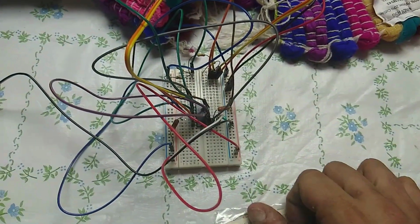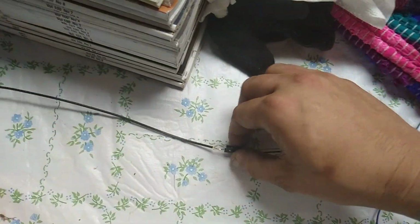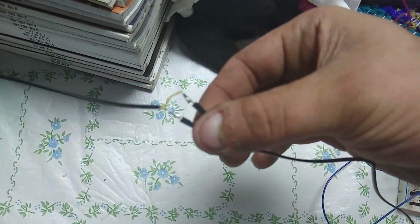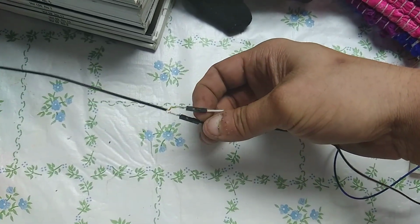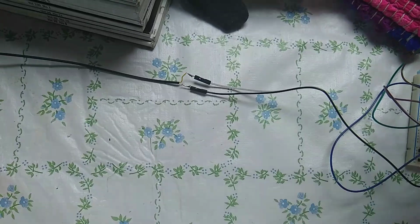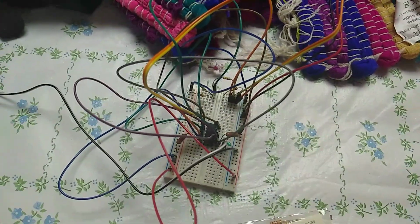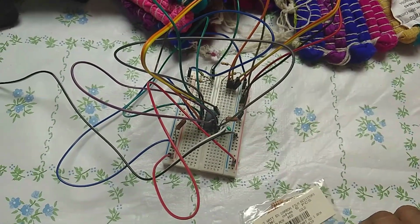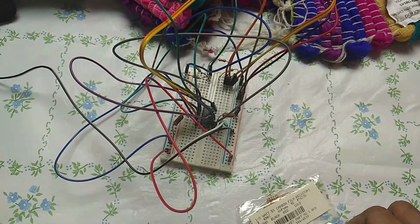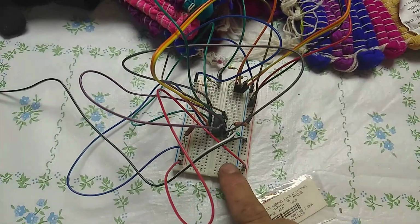The reason you have to do this is because not only is CI-V strictly a one-wire interface, as you can see here, kind of when it focuses, there's this one wire, which is literally just a ground and a signal wire. But there's also a difference in level, because the CI-V is 5 volts and Raspberry Pi is 3.3. So that's all this is.